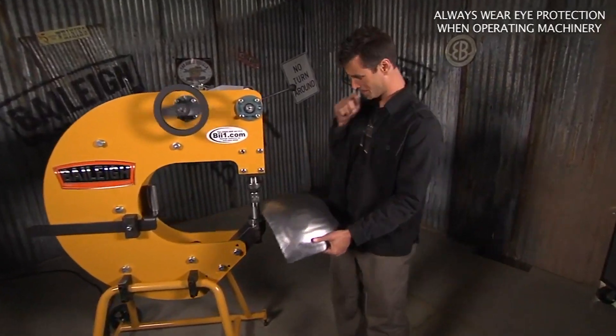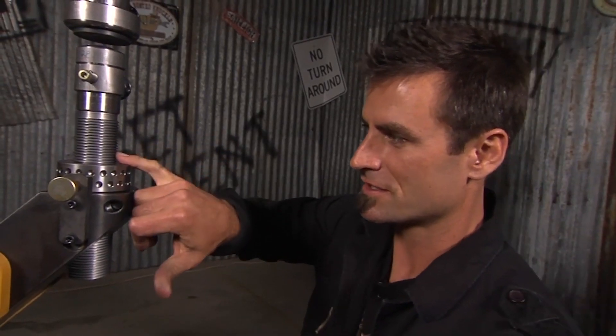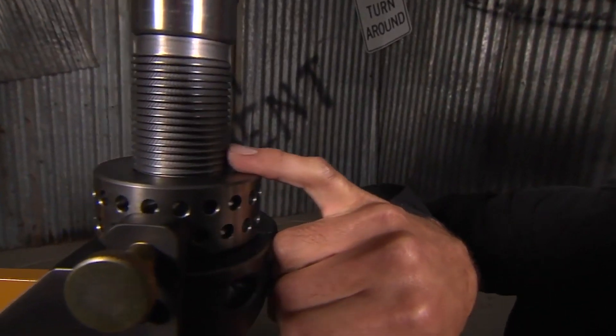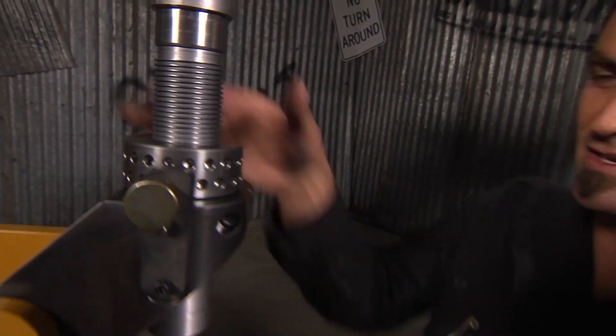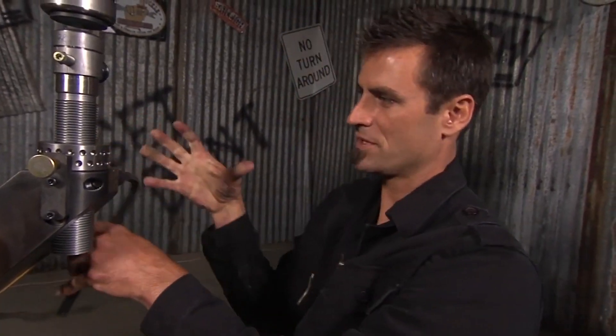One of the things I really like about this machine is it's got a good solid base. Look down here — it's got a square thread. That square thread allows you to really push down on it and keep it good and solid without moving. Now in order to change the die, you loosen the set screw here — this is clamping that thread.